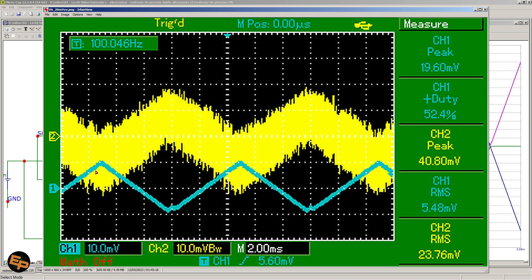We need to be aware of this, because if we just search for this topic on the internet, find this circuit, and blindly use it, we might have some negative surprises. This is something I've seen nobody actually telling, and it's a general thing — most people who post circuits on all sorts of websites do very shallow tests and don't specify the range of parameters in which their circuit actually works. They always test with very good input signals and very good conditions. This clearly shows us that we need to do our own research and our own experiments to make sure those circuits work well.